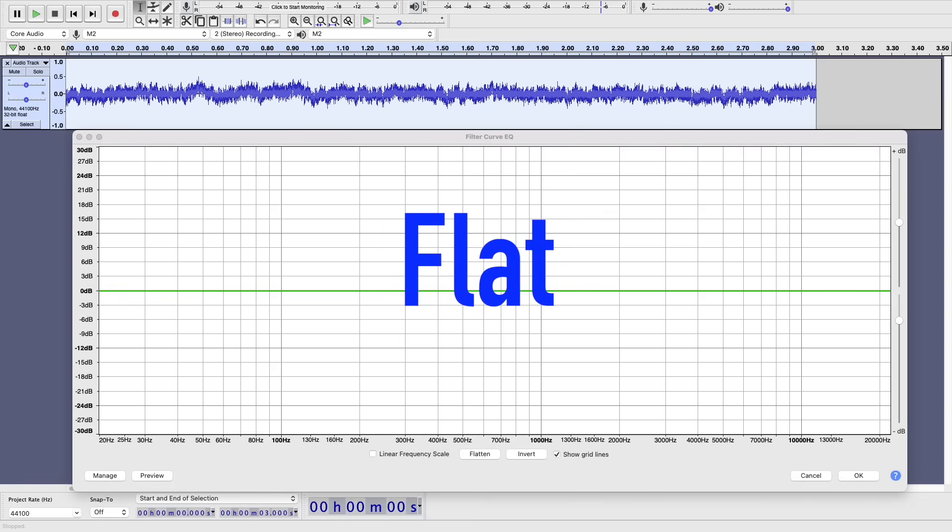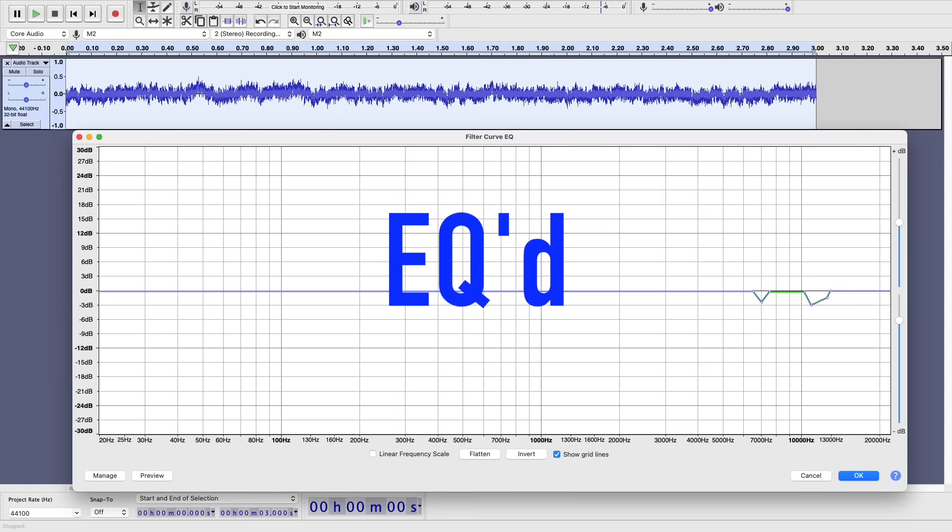What I'm going to do is play you some correlated pink noise — flat first, then switching to correlated pink noise with some parametric EQ to emulate this, so you can see if you notice it and if it's a big enough difference. We're talking about on-axis and slightly off-axis response, so keep in mind that what you hear in a room is more of a culmination of the early reflections. That's going to vary the response depending on how you have these speakers aligned — toed in, toed out, on axis. I'll let you make that decision whether or not this is going to be a problem.